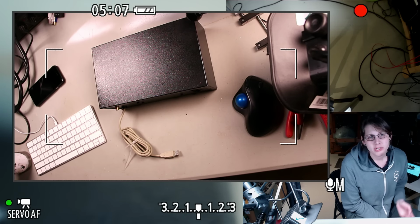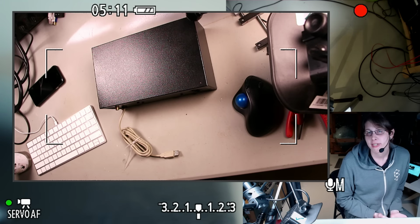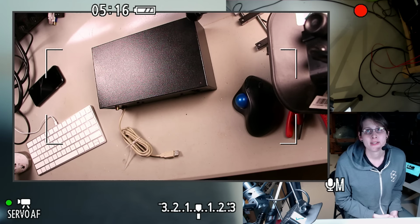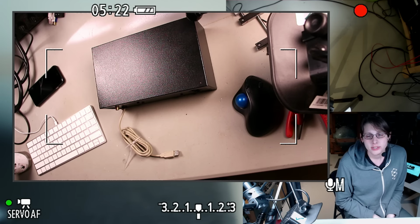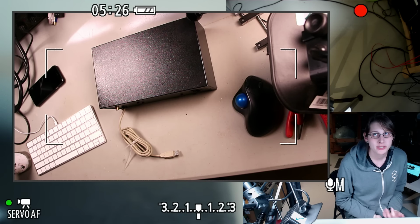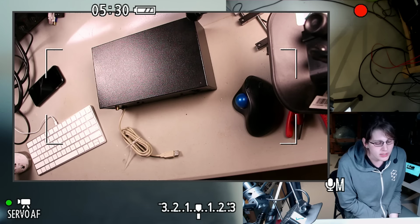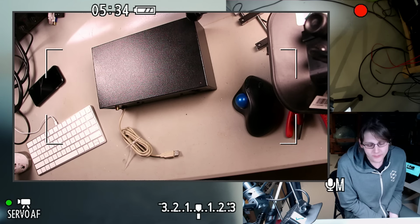If you've done any USB device programming, you've probably seen bulk transfers, which act like reading or writing a file or a pipe. Or there's fancy stuff like isochronous transfers, which are used to transfer data at a well-defined rate for audio or video. And then there's control, which is ubiquitous in all USB devices, because that's what is used for setting up the device at a protocol level, and it's also available for the device to use in its own ways.